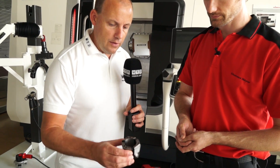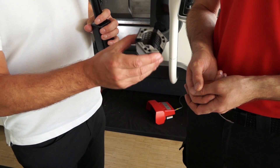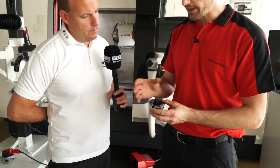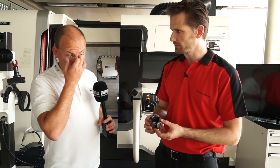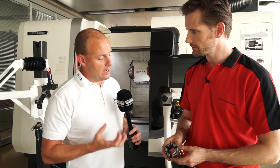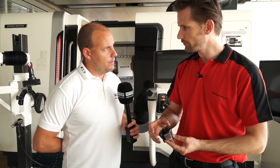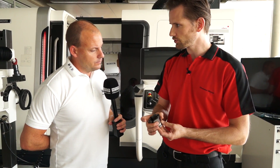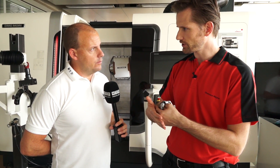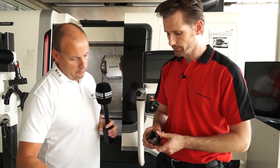Here is an example of another clamping head — that would be for bar that's rougher, for example. That's the hexagon clamping head version. I would without hesitation recommend this for bar work because it's much more rigid. From a hexagon perspective, in practical use the clamping forces are higher. The hexagon makes it more resistant to contamination and it also reduces vibration because you have full surface contact across flats, which is far greater than it is on the diameter.